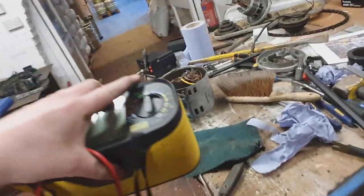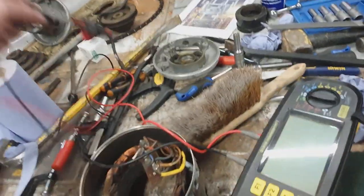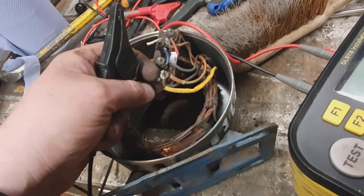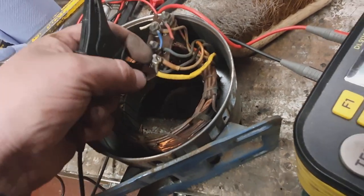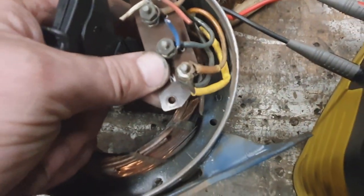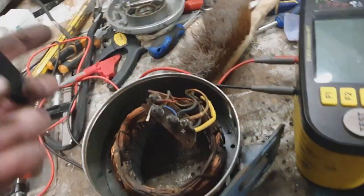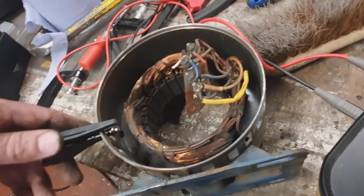Fortunately I found what I think to be the culprit. There was one of these — because I think it's wired to a star configuration, all the wires come to the centre and it's just marked neutral, but it's a star configuration. This particular lead here was completely corroded. When it's in position you can see it was quite close to the edge of the frame — I wonder if there was any arcing that happened there. Anyway, it was the insulation that had corroded on it.